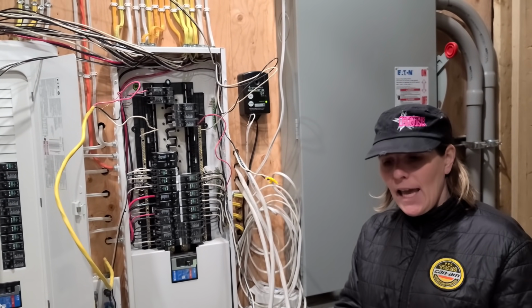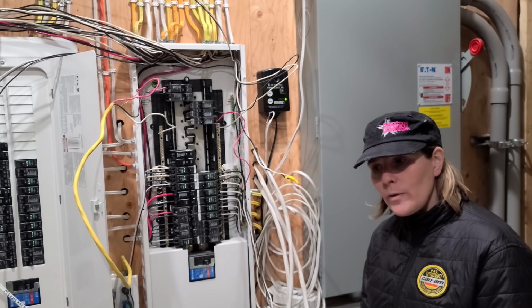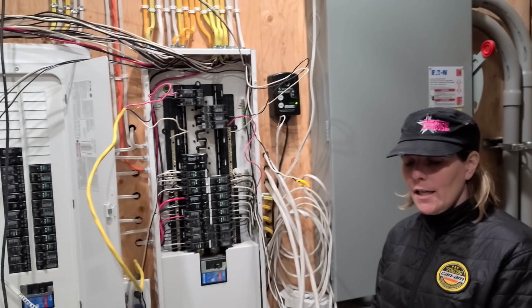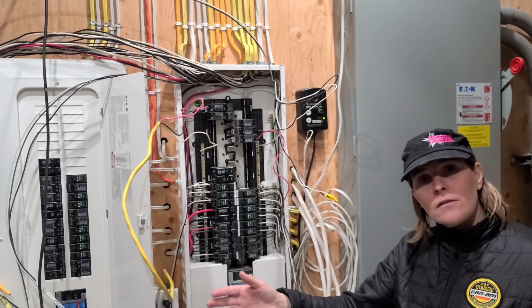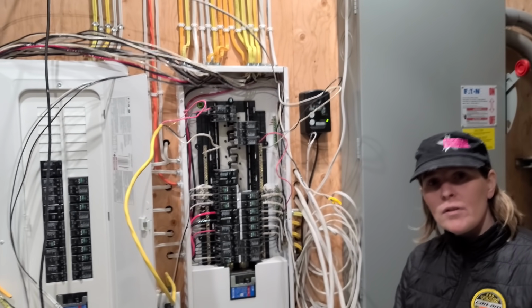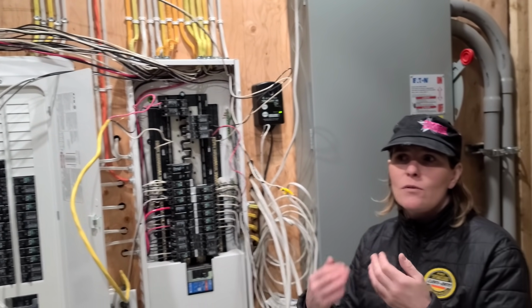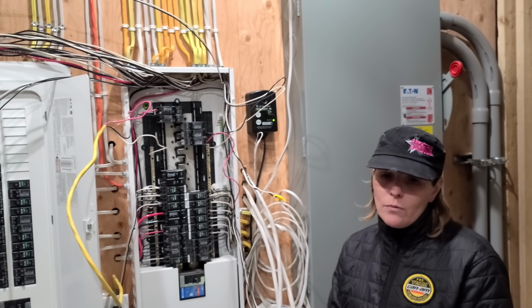And the holding tank for the gray water is only around 200 gallons, or 300 gallons maybe. Not huge, eh? And so it pumps off more frequently, so it doesn't freeze up. Say if you were doing a couple loads of laundry, the dishes, the dishwasher, a tub, it would pump off. It would never sit for days and days. Right now it's sitting because we're only using it part time. So that's why we're having issues.